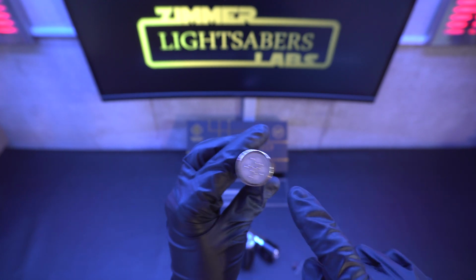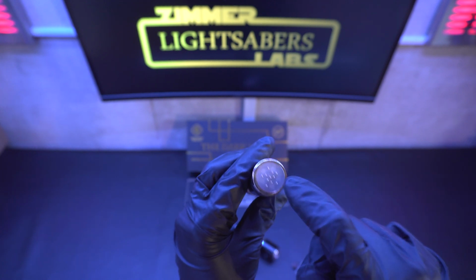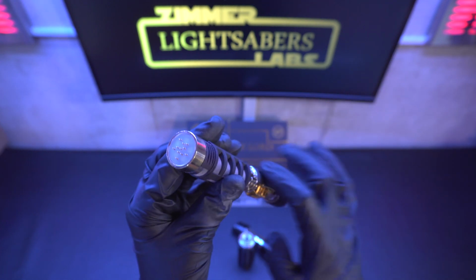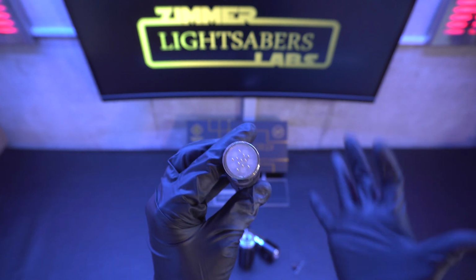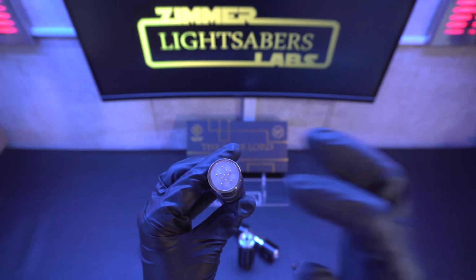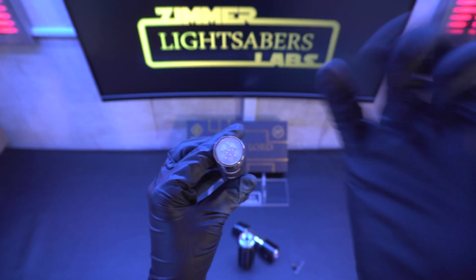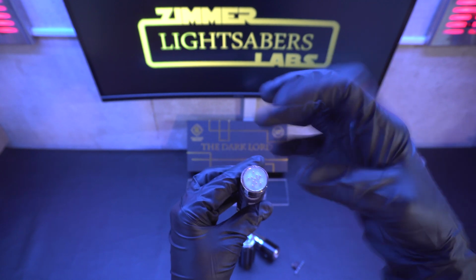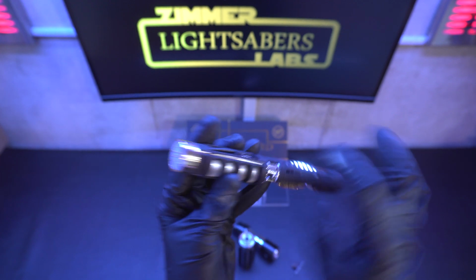And then there is an additional feature here where one of these pins, one of the ground pins, can also be segregated out and used as a blade detector pin, so that you can tell the Proffieboard, hey, there is or isn't a blade connected, in which case do this behavior or this behavior. So if there's no blade, you could do a malfunction sound, or if there is a blade, you could have it set up so that you could stick a blade in to recharge the lightsaber if you had an adapter you built to go in the blade end. There's a lot of different things you can do with the blade ID button or pin.